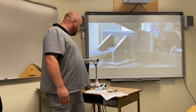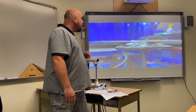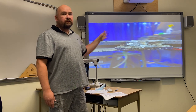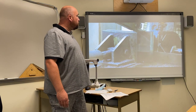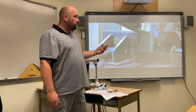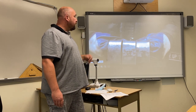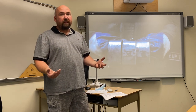After the inspector has passed this off visually, we're then going to go and gouge the backing plate off. Once we've gouged the backing plate off, you're then going to cut your plates into inch and a half coupons. These are being stacked in the bandsaw — we stacked three sets of plates together to make it more efficient. After you've stacked, you're going to bend your plates and then the inspector is going to evaluate. You bend two roots and one face bend, and that shows the quality of the weld.